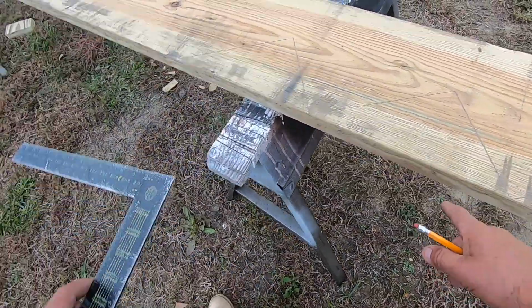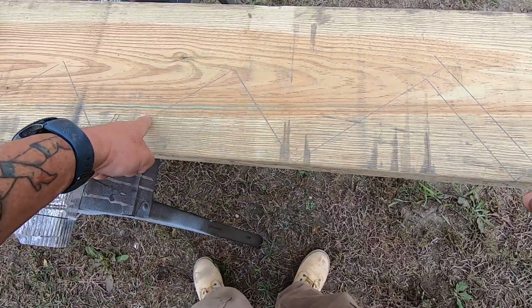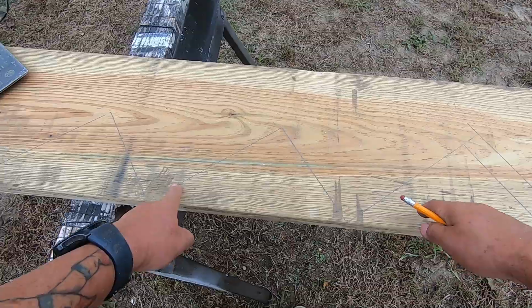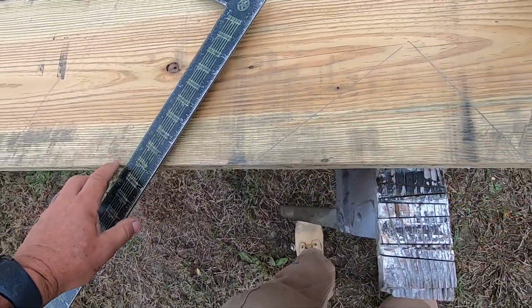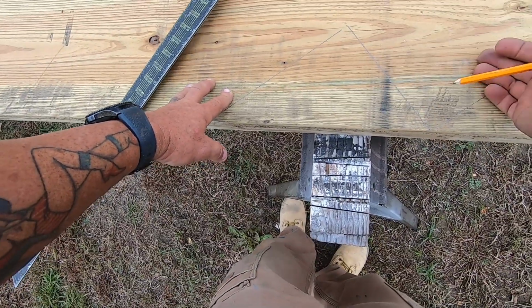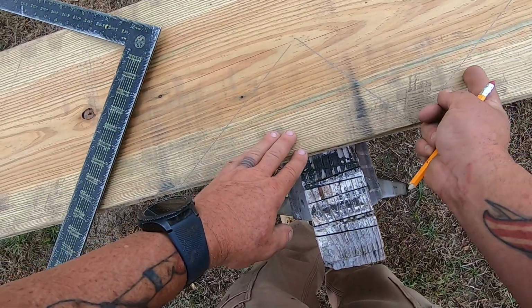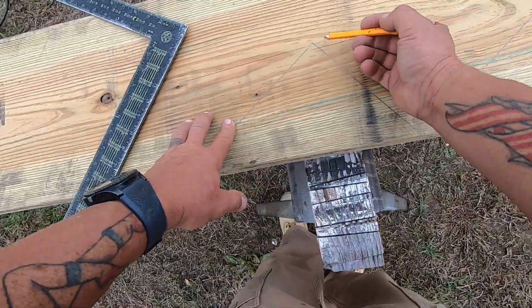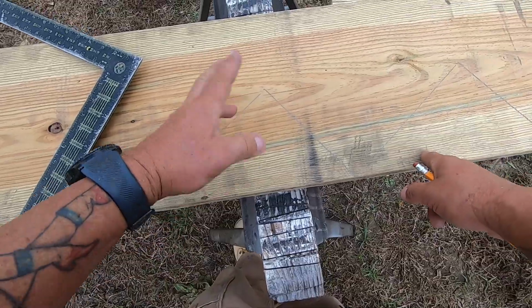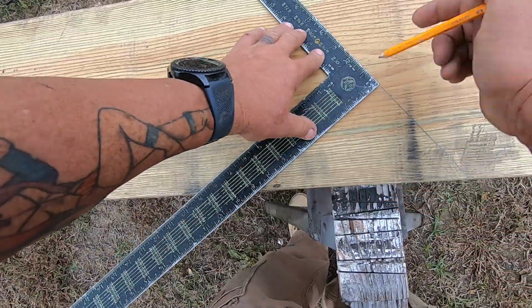And then down at the bottom, this is the first step, second step, really the third step, but there'll only be two steps till you touch the ground. And this is the part where, if you were putting this inside a house, you would have to take off the 5/4 so you'd have the same size step here. But in this case, we don't have to. This one can just get cut.